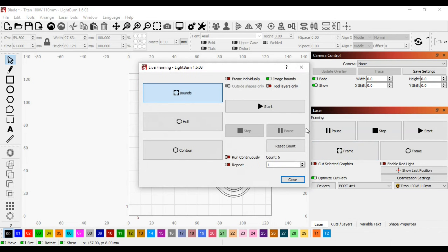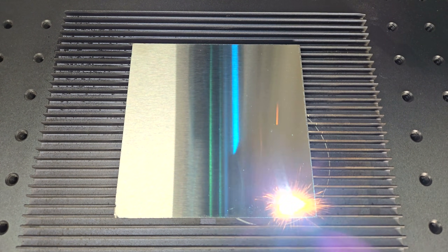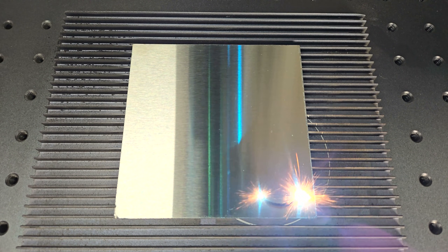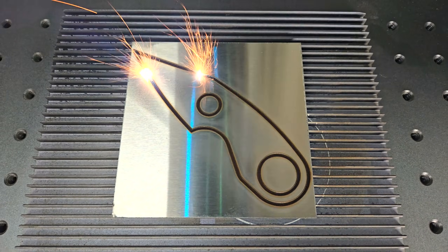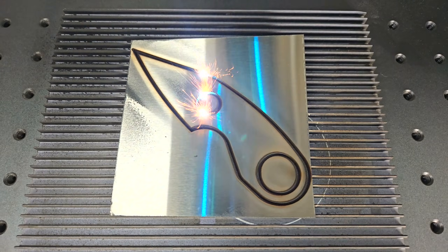This provides space for debris to be blown away with a fan, which I recommend using along with some sort of fume and dust control, because it will fill the air in your workshop — the last thing you want to be breathing is fine metal particulates. I'm just using some 2mm thick 304 stainless steel that I had on hand, which is not ideal for any sort of blade because it can't be heat treated properly and it won't hold an edge for long, but it'll work fine for this demonstration.